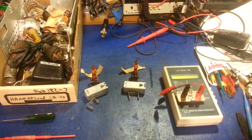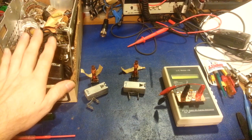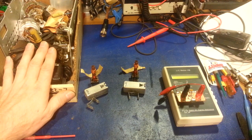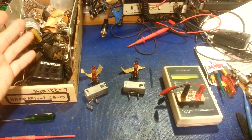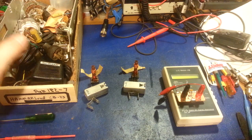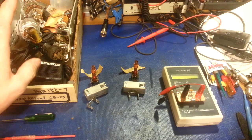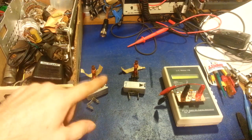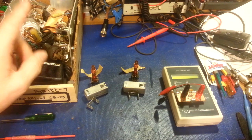And at 100% modulation. Back in the old tube days, what they rated it at was input power, and a lot of people will see '5 watts' and think the old radios do more power. Common misconception — you really have to read the fine print. If you look at it, it will say '5 watts input.' That's how much power is being used to create your output power.